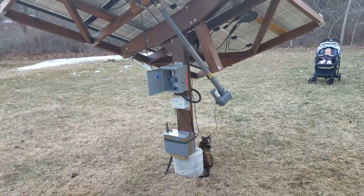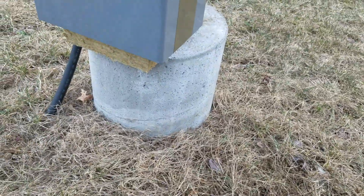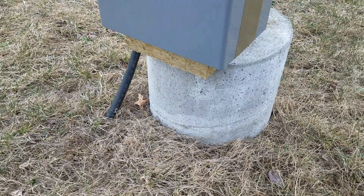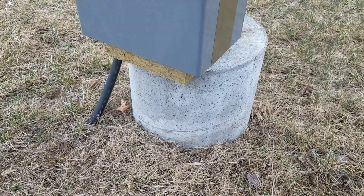For the concrete in the ground, in basically the bottom two and a half feet of it, I drove rebar from the inside out into the ground on an angle, and that helps stiffen it up with the rest of the ground too.